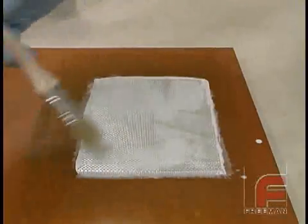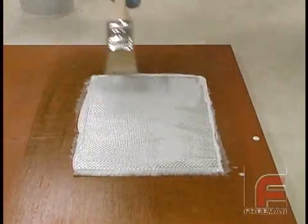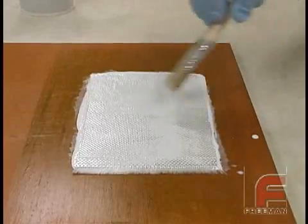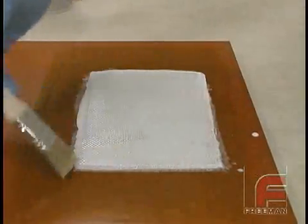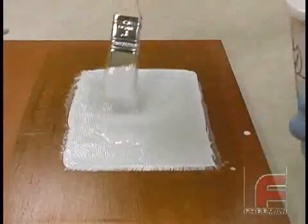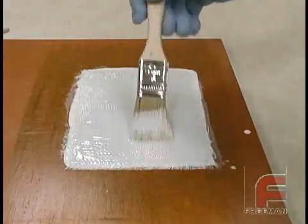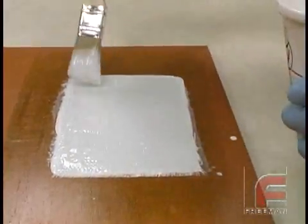For additional sessions, we would need to prepare the surface for the first laminating adhesion layer. One way is to wash off the tool, as it will feel a little greasy, and then sand it a little. Another way is to take a cotton flock and sprinkle it over the last layer before we go, then the next morning we would blow off the excess and then start applying the resin.